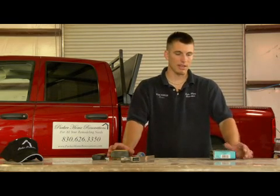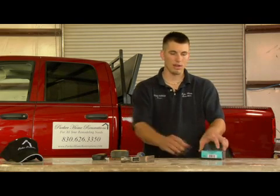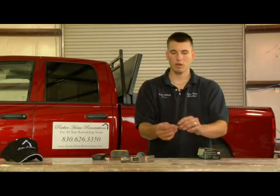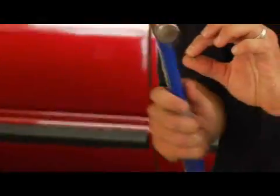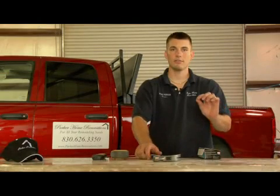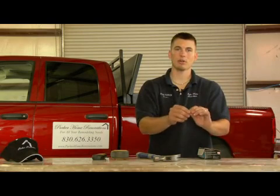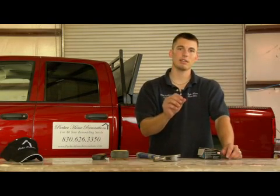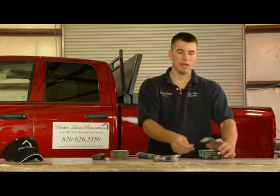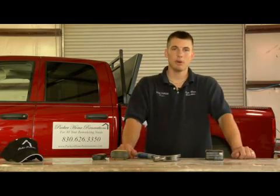Another way you could find studs is you could get a nail like these here, a roofing nail or a brad nail or really any type of nail that you want. And you could hold the nail and you could nail it through the sheetrock until you feel like you hit something solid. If you hit something solid, it'll be real hard to pull it back out with your fingers. You'll have to get it back out with the hammer. If you didn't hit something solid, you can just grab it with your fingers and pull it back out. Basically, if you hit something solid, usually it's a 2x4, and hope it's not a pipe.